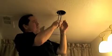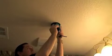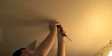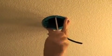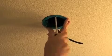Put the cable down. We've got the cable inside the box — it goes through the side right here, and this functions as a way to hold the cable, keeping these little claws pointing inwards. Then as you tighten these little screws, the claws will open up outward and tighten up against the drywall.